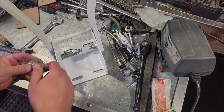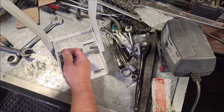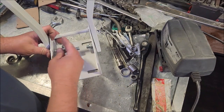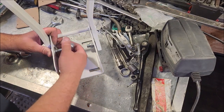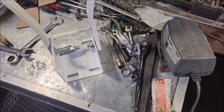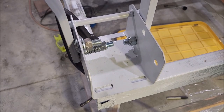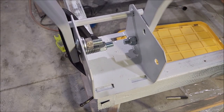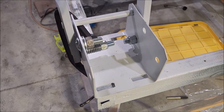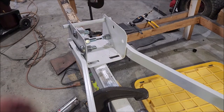Now it's time for the detents. Without the washer, that looks a lot better to be honest — I'll do that. I'll put my washer there and put a normal nut on here so I don't have to fight with the nylon lock nut. Let's see if this works. It slides over pretty easily — I think the weight of it going down the road it would just fall over, so I need more spring tension. I've got both detents on. Part of me is tempted to cut the nuts off here, but I don't care. Also, this is the shortest half-inch carriage bolt the hardware store had.